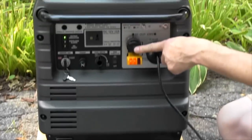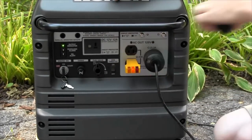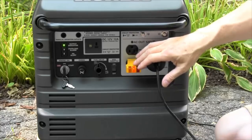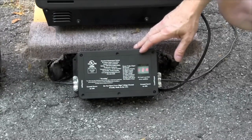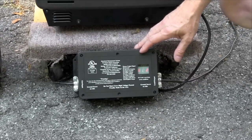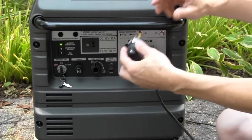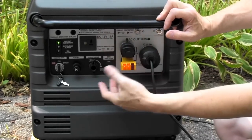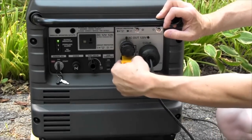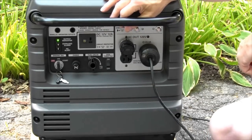If we go back up to the top and pull our neutral grounding plug, all of a sudden we'll see this is reporting an open ground and stopping the current from getting through. So you do not need to leave your three-light detector plugged in — that's just for illustration. You will just need the grounding plug plugged into any of the receptacles on your generator.